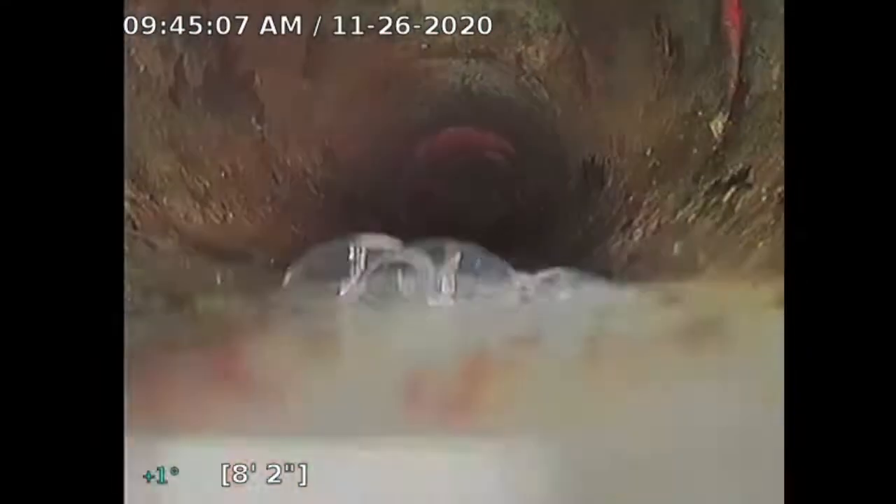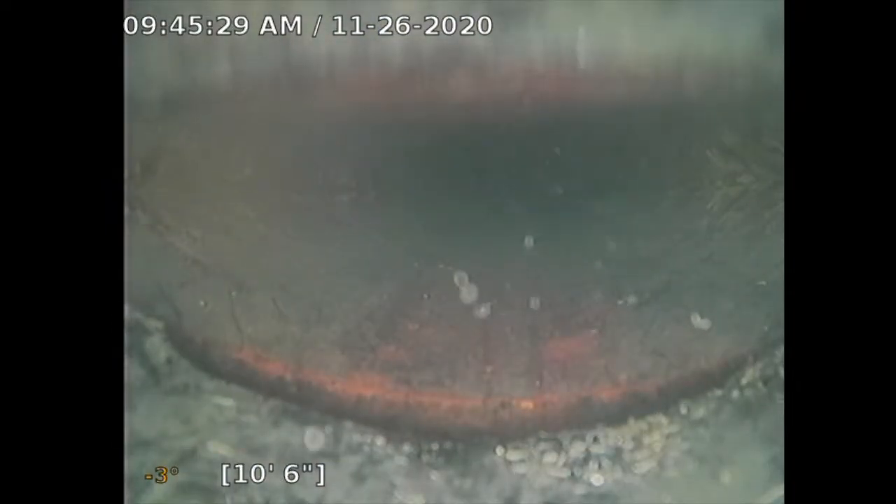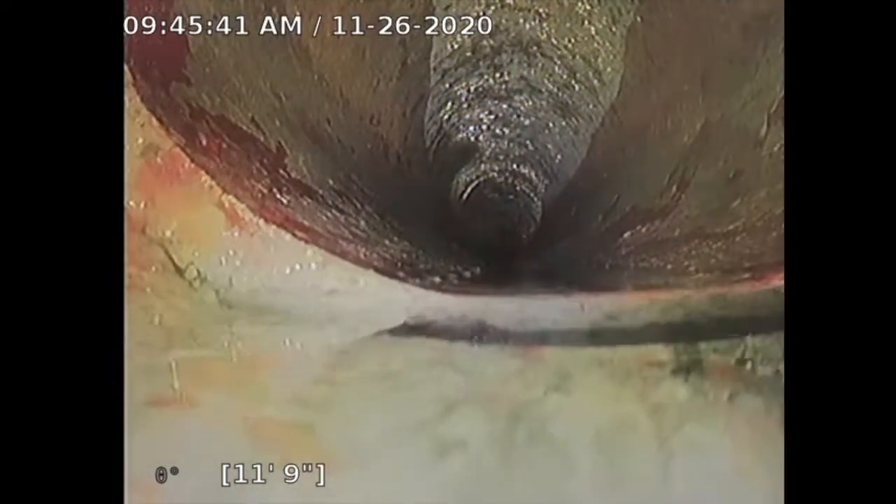See how this pipe is sagging? It doesn't have proper slope — I'm getting plus two on the slope reading. The pipe is collecting water there. At this point it does need repair. On the left it looks orange, which tells me that pipe has been underwater for quite a bit and is just collecting junk and gunk. It's still sagging, I'm getting a little better slope but it's still underwater.